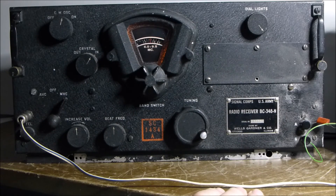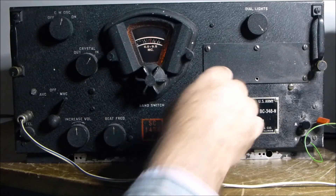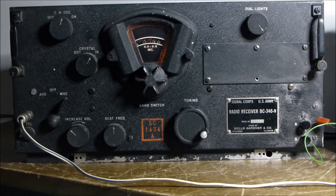The whole set is completely realigned, centred on the crystal frequency. It rings very well. Unlike a lot of sets of this vintage, the trimmer-padder setup I'm normally used to seeing isn't there on this. Normally you adjust the inductor at the bottom end of the band and the capacitor at the top end to get tracking of the antenna, the mixer, and the first IF. This set, according to the manual, you only adjust for a spot frequency about 70-80% up the band, and this is what this unit has been adjusted for. I do notice it drops out of registration as you go lower in the band.